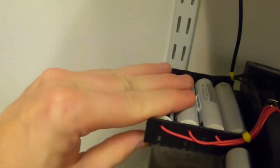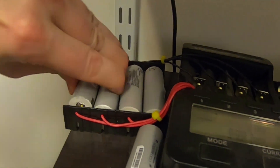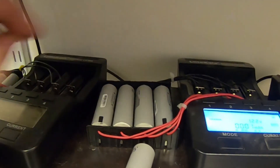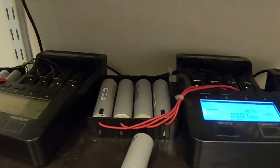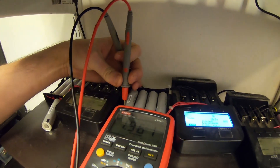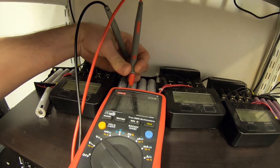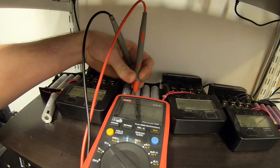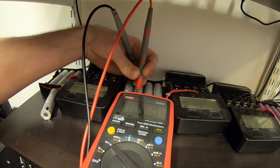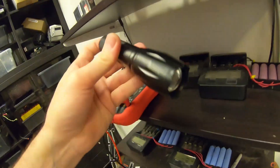These cells are a little hard to get out. Now it's in the dead zone where it doesn't even want to recognize them. If you want to play with these cells again, you have to wait until the voltage drops. They are at 1.96 and 1.85 volts. My theory is confirmed: if they are between 1.8 and 2.0 volts, the Litokala will not recognize them — it knows it's not NiMH and won't charge lithium-ion cells unless they are above 2.0 volts on insertion.